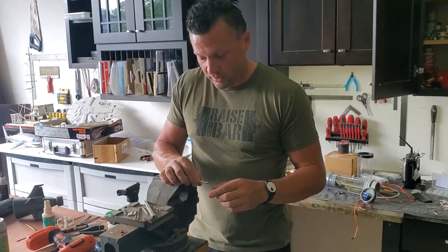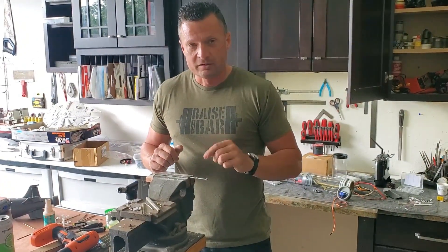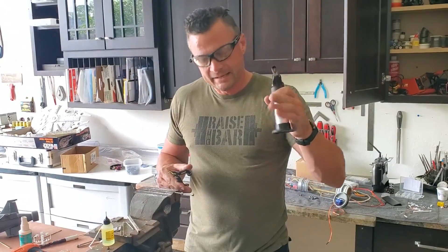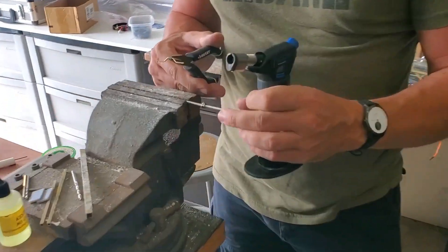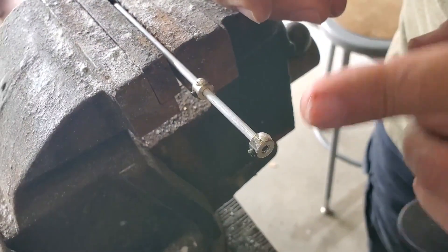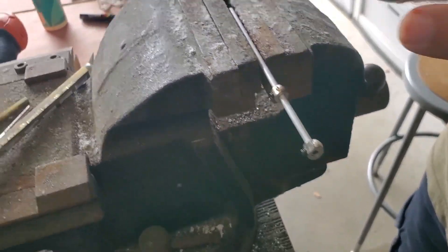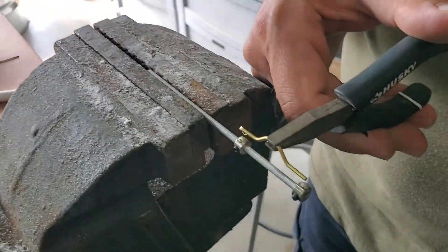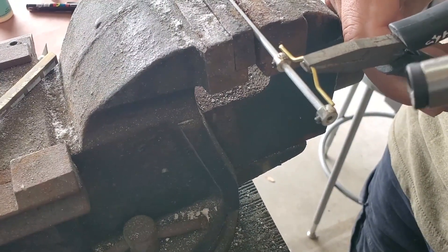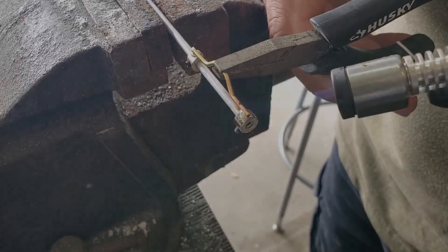What I'm going to do is prep this by pre-tinning the wheel collars with a little bit of solder, then we'll get to assembling it. If we zoom in a little bit closer, you'll see what I've got started — the plated wheel collars sitting in place, both set screws oriented in the same direction, which is important. I've pre-tinned them with a little bit of silver solder and I've got some liquid flux on the brass, so it's all ready to go. I'm going to set this in place, heat it up, and that solder should flow right onto the brass.